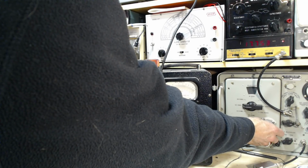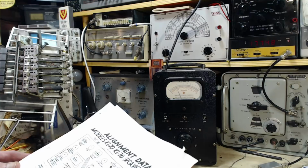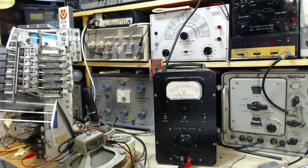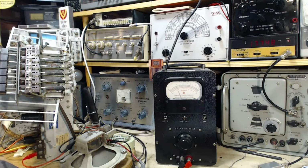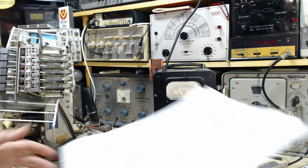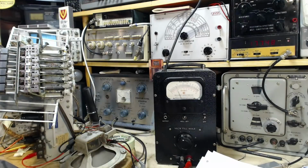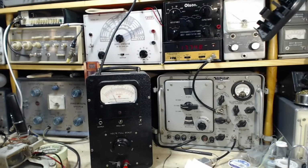Very accurately now. Concentrate, man. There, 17.75. And I think it's 17 degrees on the big wheel. Okay. 17 degrees on the big wheel. There's 17. We have to do the inductor L12. L12 is right here. Interestingly enough, this one's down quite a ways. So, find my little screwdriver. Now, don't get jumpy on me now.